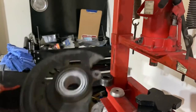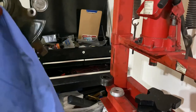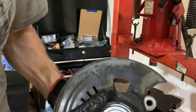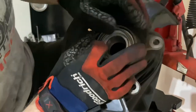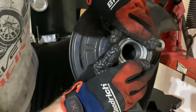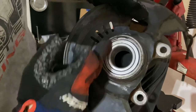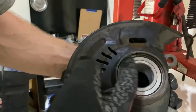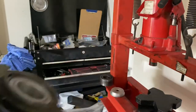Let's see if I can show you how you're putting the snap ring in — it's pretty simple. Getting it out and putting it in is pretty easy work. You don't even really need any special tools. I essentially just pushed it in with my fingers — you heard it snap. Then just get a flat blade screwdriver and tap it around with a hammer to make sure it's fully seated in that groove. And you're good to go.